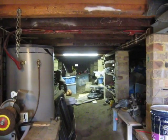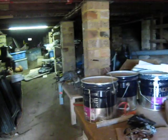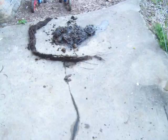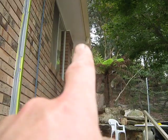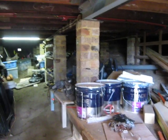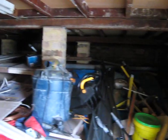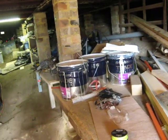Today is the next day. Before I started reconstructing the path I had to break up to inspect the plumbing. I did a few tests this morning and the water runoff wasn't too good. When I inspected the pipe underneath the house, I found all this gunk in the pipes. When I tipped a bucket of water at the back of the house, the drainage at the far end near the road — the last couple of buckets didn't come out at all. I think what I've done is with the tests of tipping buckets along the pipe under the house, it's dislodged a lot of mud and rubble and just pushed it forward and blocked it.